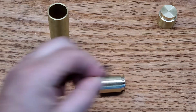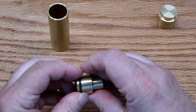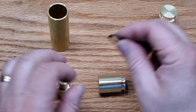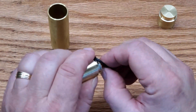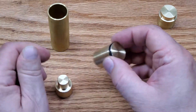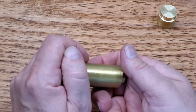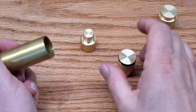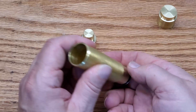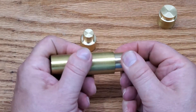That'll all be changed depending upon the stroke anyway. That is where the o-ring is going to fit in a finished piston, but to test it out I'm going to use the blank, because I can always just turn this one down to the size of the other one if I decide to go the friction fit route, or I can put a groove in it if I decide to go the o-ring route. I left it a little bit oversized - it's a very snug fit, but I'm going to put some lubricant on it and it does actually move quite nicely.